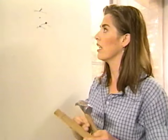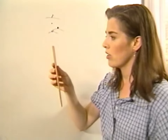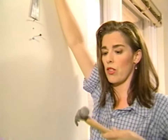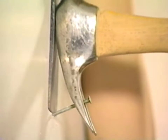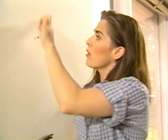At least the wall will be smooth. We'll start with that ugly looking nail. You don't want to wreck the wall even more than it's already wrecked. What I'm going to do is use a hammer to pull this nail out in the direction in which it was nailed into the wall — it's on a bit of an angle. You can use a shim like this little piece of wood, or this pry bar, which is even less likely to put a ding in the wall. I'm going to hook the hammer and push against the pry bar. There we go — that's left a small hole in the wall, which we'll patch.